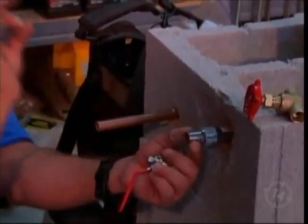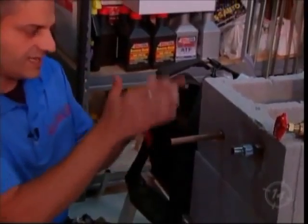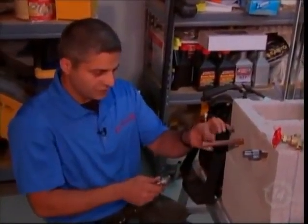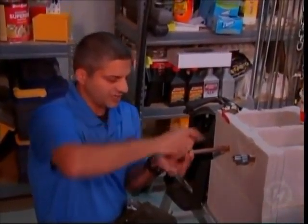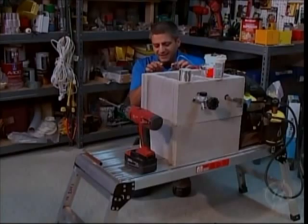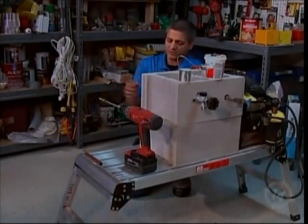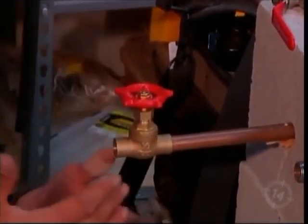The frost-free unit does not need a shutoff valve. Now, if you happen to go with still a nice ball valve, but it's not the frost-free unit, you have choices here. So on this side, if you do have to use the shutoff, again, the number one problem that I find, I replace these all the time. This design, if you don't turn it on and off every month or so, it seizes. And then that one time when you need to turn it off, it's going to drip.